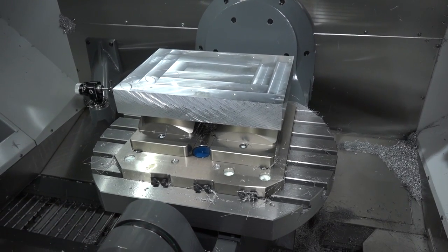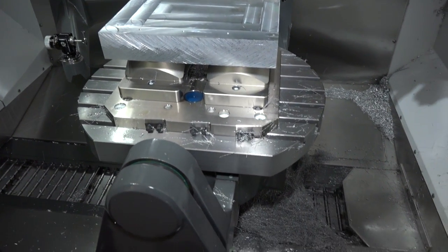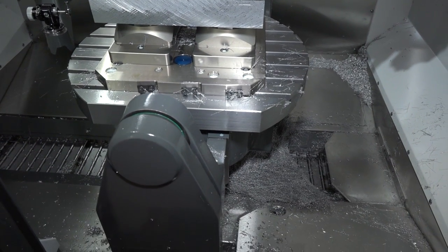On that probing, so you're measuring your tools and making sure that your tool offsets are correct? Yes, that's correct. Another point is the access and the way the internals are laid out on this machine. The conveyor centrally for removal of swarf — is that an efficient way of getting rid of the metal? Yes, it's very efficient. What we find is the width of the conveyor, the speed at which it moves, and also the angles of the surfaces that deflect the swarf down — a lot of the swarf is just cleared out in process, so it works very well.